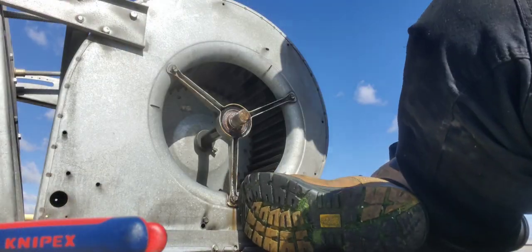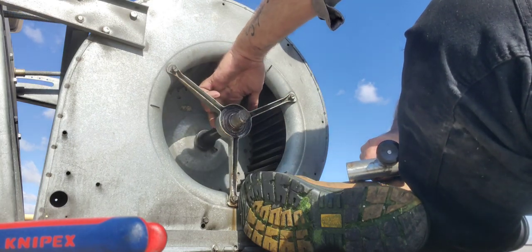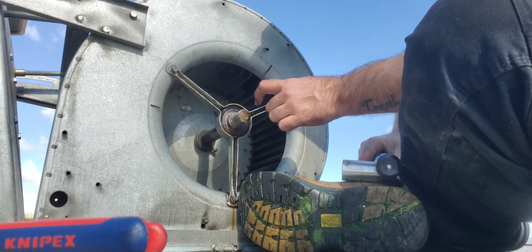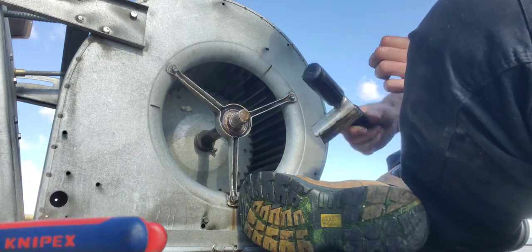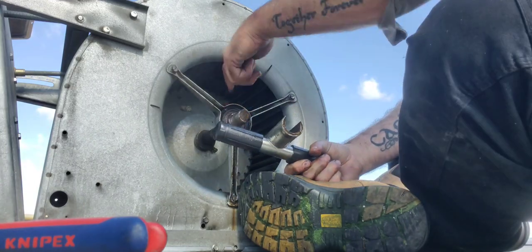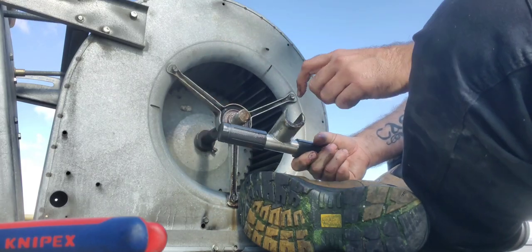What I found with this particular spider bracket is there's not a lot of space in the back — a very small gap, which is not the norm. I usually find the opening is quite large, where the whole tool should be able to fit back there and hit the bearing. But with this spider bracket, the tool is actually hitting the back of the bracket housing and not the back of the bearing.